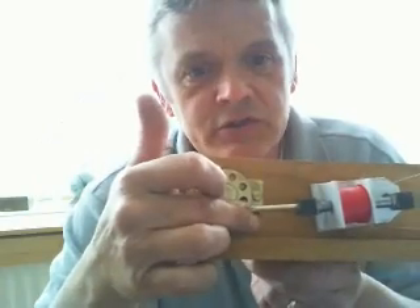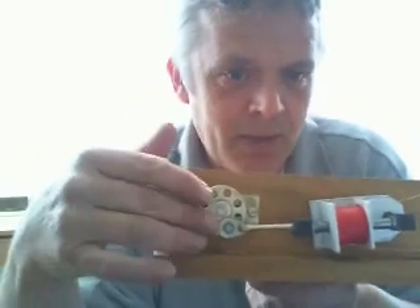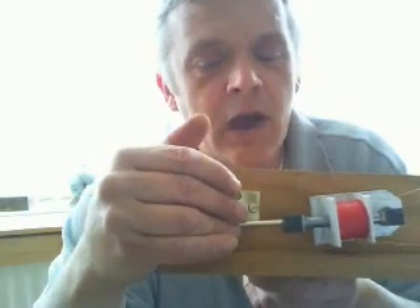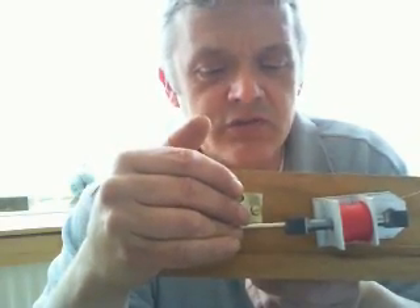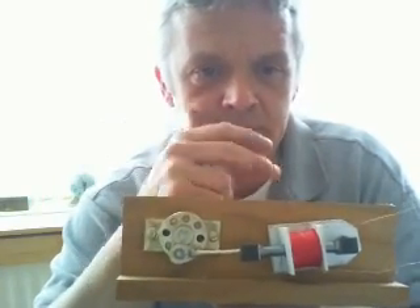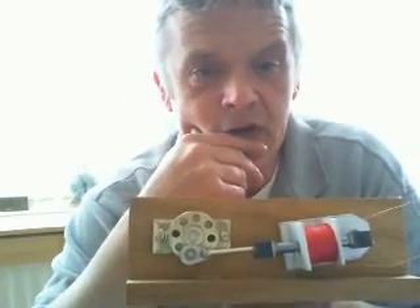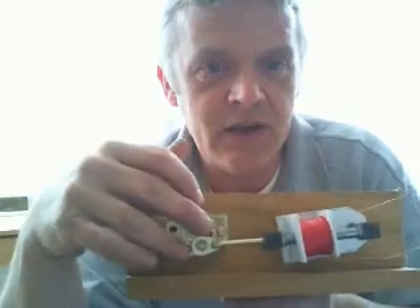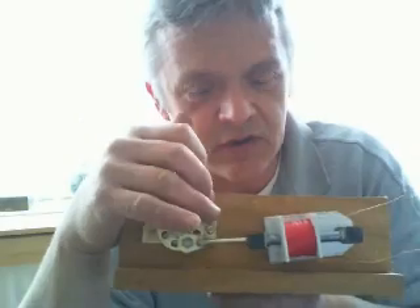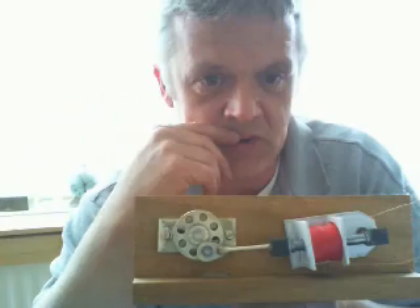That micro switch could clearly be a two-way switch. In one position it's going to be pulsing power in, and then in the other position, once it leaves that, it can be connected straight back to a capacitor or the back EMF line, and we can capture whatever is going on in this coil. There are going to be two major components in that coil — the back EMF from the collapsing field, and also some component of EMF generated by the magnetic field moving through the coil. So it's going to be really interesting to see what comes out of that coil compared to what we put into it in this simple reciprocating arrangement.